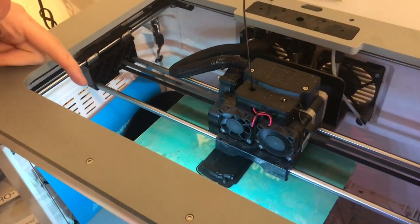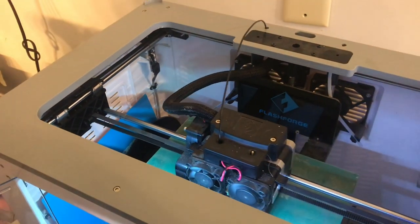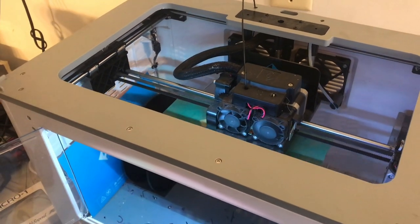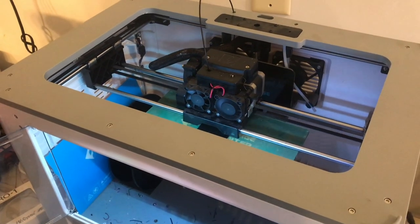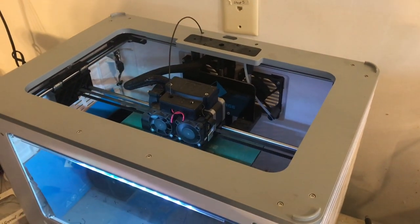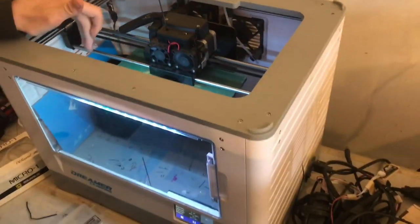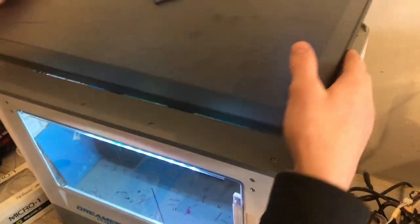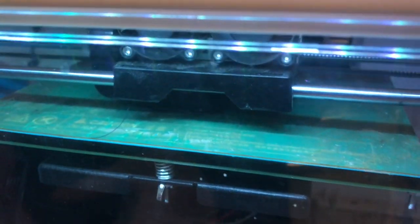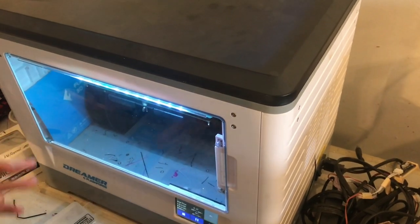This is better than what we had before. We had to have the line going out here and then have the spool sitting outside of the machine, and you'd have to check it, make sure it was loose periodically. Now I can just let this run, and this is a longer print, and I think it'll work just fine and keep feeding. Having the spool inside the machine means we can put the lid on it, which will actually help the environment temperature — it'll keep a higher temperature, which does help your prints. It can help it stick to the bed and just come out nicer, so it's nice whenever you can keep the heat in the machine.